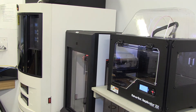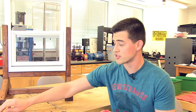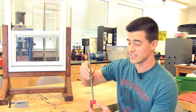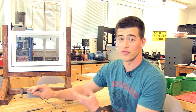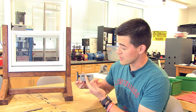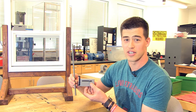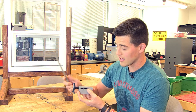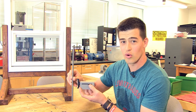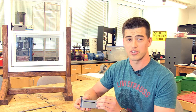For the Window Wizard, we've made several of these components on the 3D printer, a couple of which I have right here. This one is just a lower rod holder — it will sit back in your window, keeps the rod from moving out of place and keeps everything nice and in line. Second, and one of the most important features of our window, is this manually unlocking mechanism. What it does is it actually slides back and forth — at this position your rod would be disengaged and you could slide the window up and down freely.